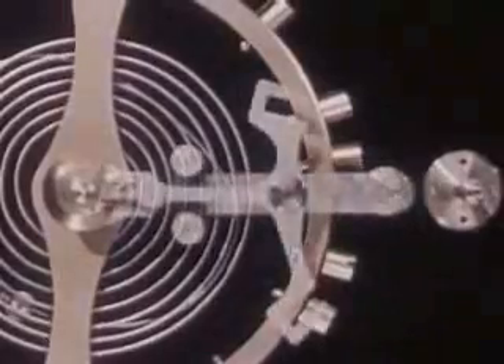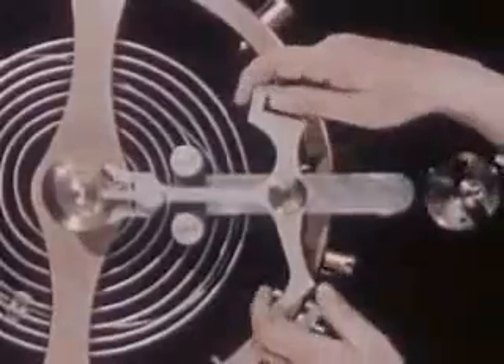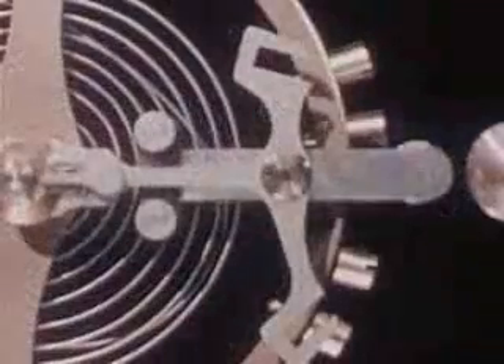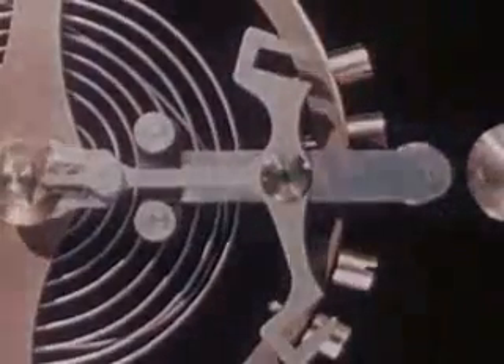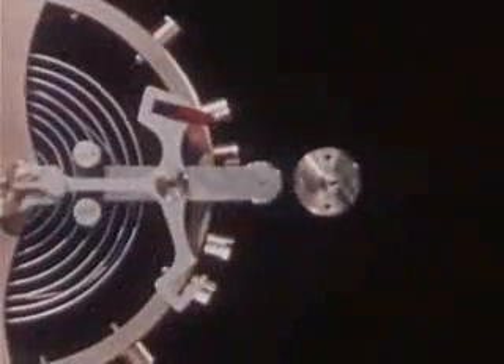To do this job of pushing, we need this odd anchor-shaped lever called a pallet. It can be mounted so that when we move the pallet back and forth, we can apply a series of impulses to the jewel pin to keep the balance wheel in motion. To the pallet cross arm we add a pallet jewel shaped like this.